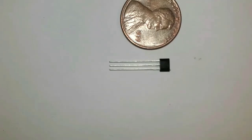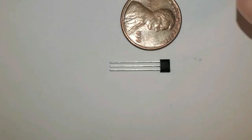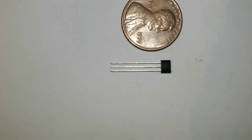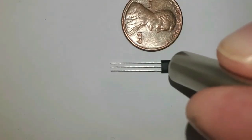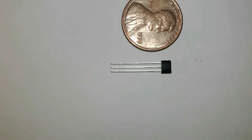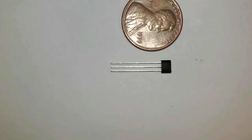Across the wire develops what's called a Hall voltage. If instead of using a wire you have the current flowing through a real thin square plate, you could have a meter on one side of the plate and on the other side. If you place a magnet, in one orientation there's a positive voltage that develops, and with the other pole of the magnet there's a negative voltage. That's what a Hall Effect sensor does.